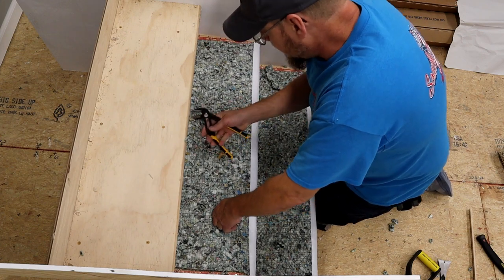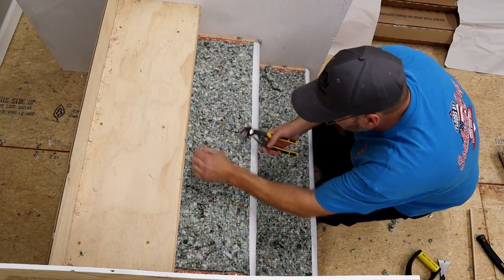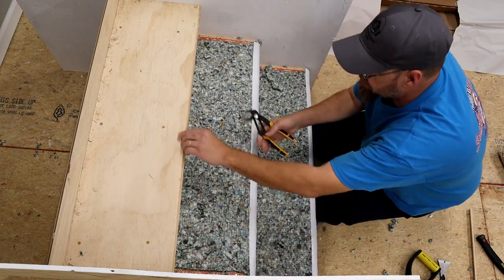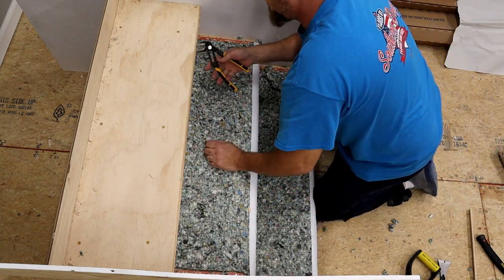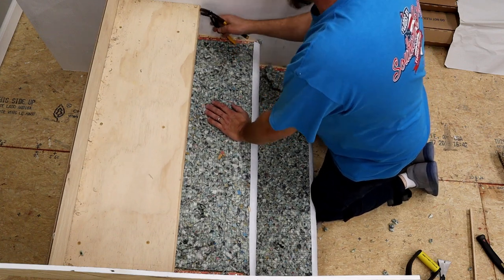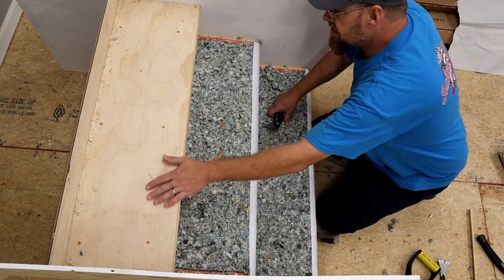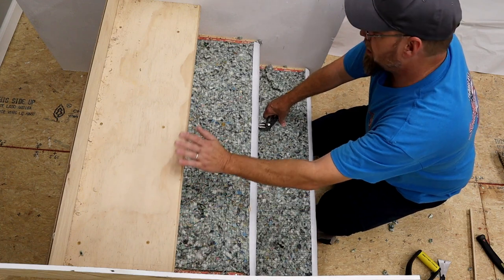We're gonna be left with a little bit of staples under the bull nose from the electric staple gun, which was actually shot through the carpet instead of the pad, okay? Those are going to need to come out too. Even if you're just installing carpet, you need to try to get all the staples out you can so that you're not just left with a whole cluster of staples after installing one or two times.